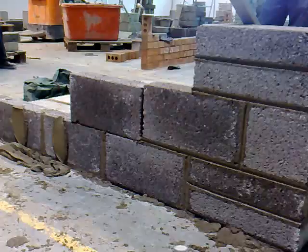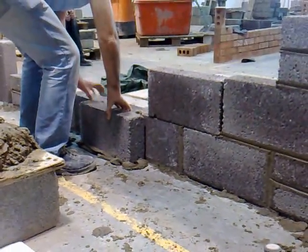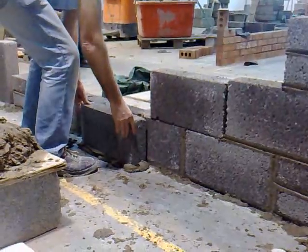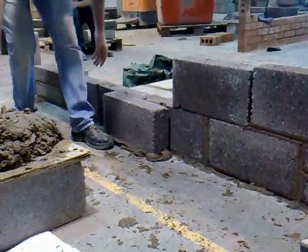All the other piers that go in between the two ends of the wall, you stagger them from one side of the wall to the other. I'll put this block on now and allow for a mortar joint there.